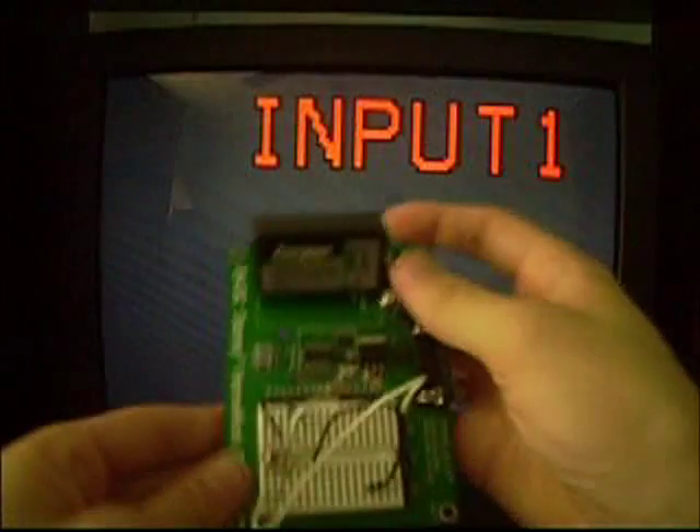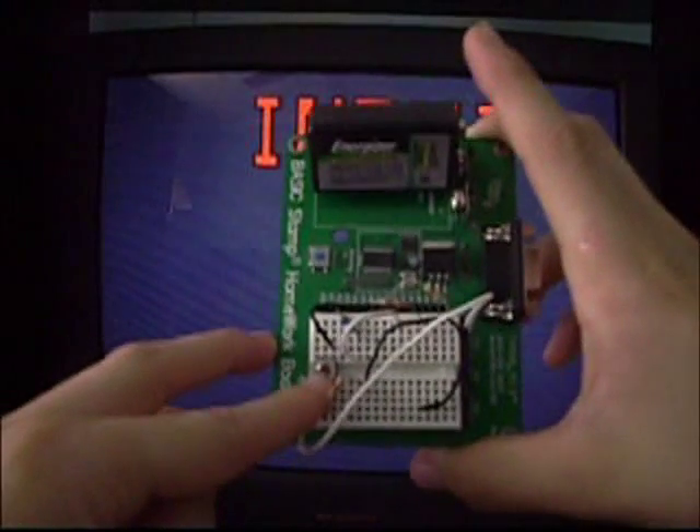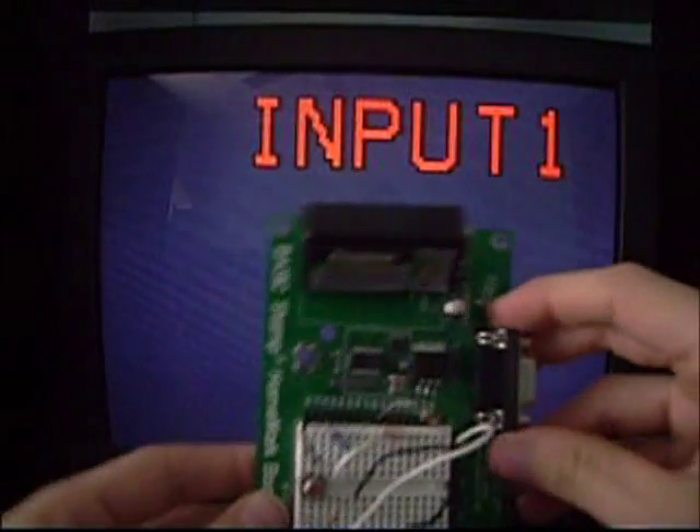As long as you have the proper software — I checked and the Basic Stamp only runs 4,000 instructions per second. Usually to generate a TV signal in software you need really high processing power, but I made a proof-of-concept circuit that generates a simple video signal and displays it on the TV. All I have on the circuit is the microcontroller, a push button to start the program, and just these two resistors which generate the video signal.